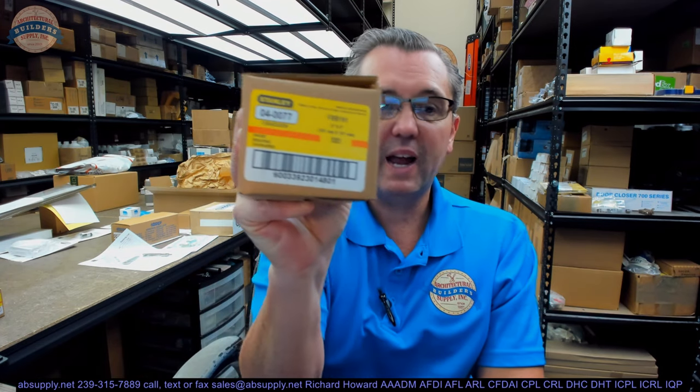There are actually instructions on how to shim a door — an industry publication from the Steel Door Institute, known as SDI. The document is SDI 122: Installation and Troubleshooting Guide for Standard Steel Doors and Frames. If you search for that, you'll find it. That document is required reading if you deal with doors — if you're a contractor, installer, or distributor, possessing that knowledge would be considered mandatory in my opinion.